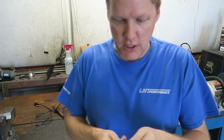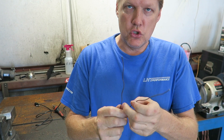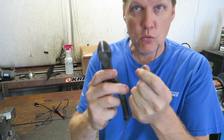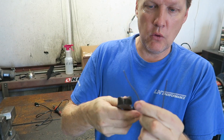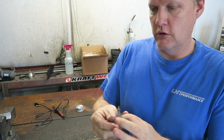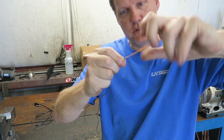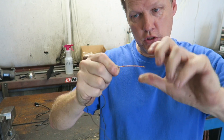Okay, so this is Tech Wednesday. I'm going to show you how to join two wires. I want to join them in the best Honda way we know — I don't mean to rip on Hondas, it's just that we get this. So what you want to do when you're going to join two wires is you want a ton of wire sticking out the end. Strip about this much off, then put them side by side and twist them. The more twisting you get, the better connection you're going to get.